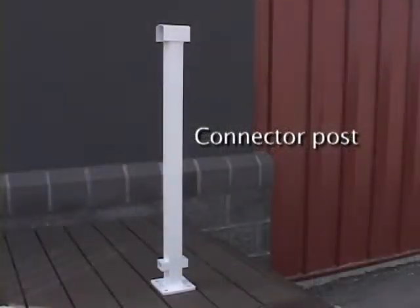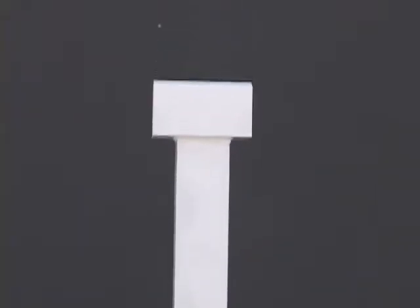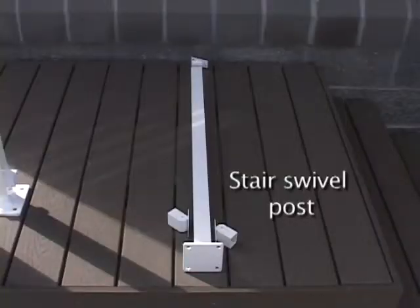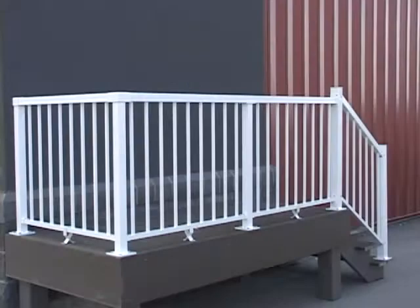Note on longer deck applications that stretch beyond 20 feet in length, or where sections of rails are joined together, a connector post will be required. And on longer stair applications, additional stair swivel posts are used between the top and bottom stair posts to provide additional support. The types of posts used and distance between post spans will vary from application to application depending on deck layout or decking substrate type. Consult your Star representative or your design professional for additional information on maximum spans between posts.